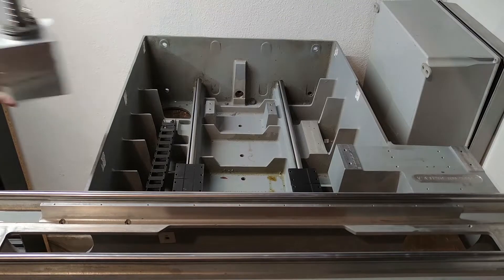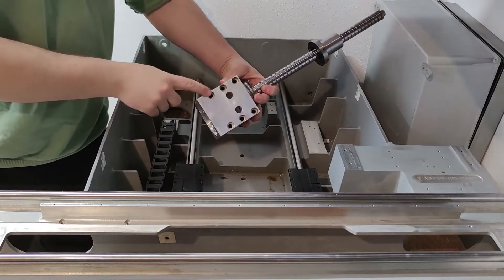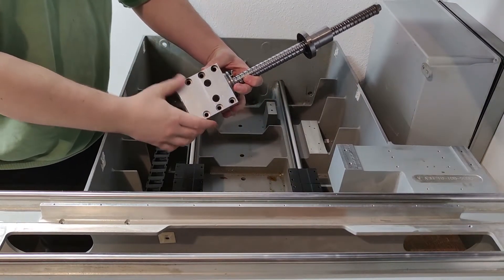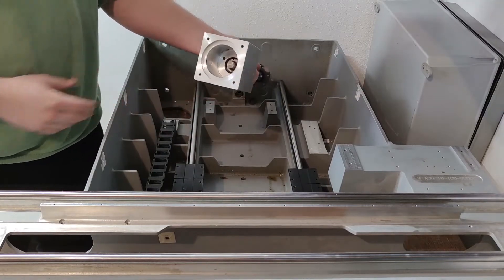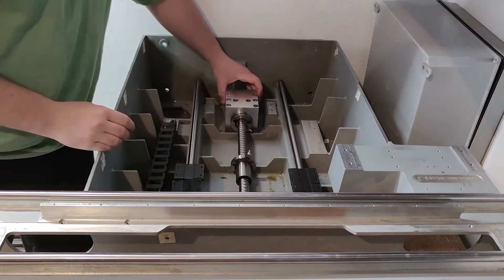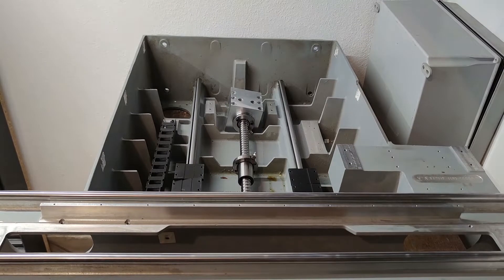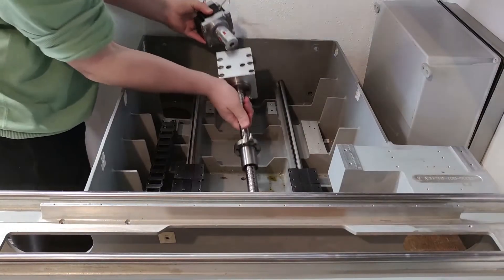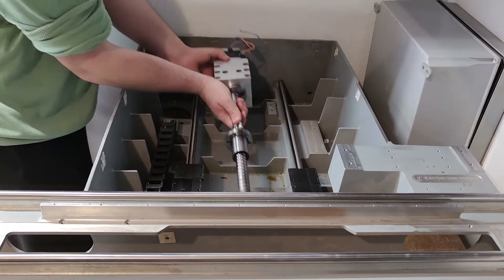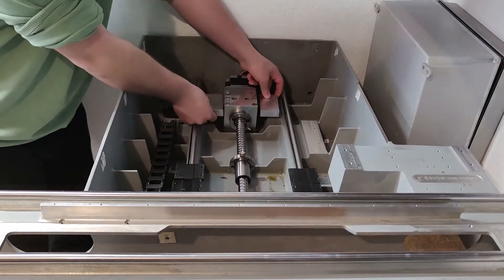For the mechanical build I first decided to mount the Z-axis ball screw and motor. I already had the motor mount with ball screw and fixed bearing from another machine, and I had the nut holder as well. Everything was very precise and I decided to adapt the position of the assembly in the CNC to the parts I had. The motor mount could not be mounted with the existing holes, so I had to improvise. I had these flats on the casting that were parallel to the Z-axis motion and were big enough to accept the motor mount. I was left with barely enough space for the motor at the back. To mount everything, I decided to machine aluminum blocks to serve as an extension that would sit on the flats.